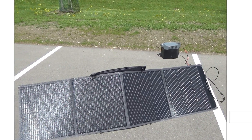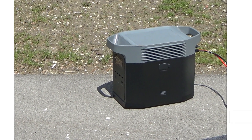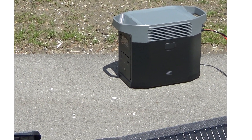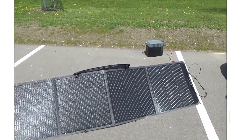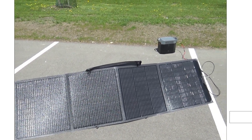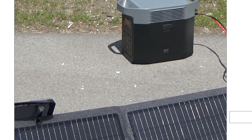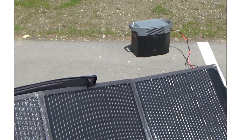The sun alone, even if it's not hot out, is going to heat up the power station. A lot of them, like this EcoFlow, have a lot of black plastic on them — that's just kind of the favorite now. At least this one has some gray on top which helps a little bit, but this thing is still going to heat up pretty fast. And when you're charging with a lot of input — like if you had four, five, or six hundred watts going in — that's going to create a lot of heat inside the battery as well.